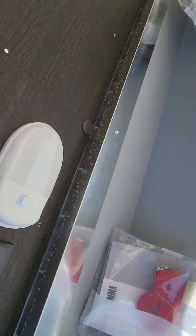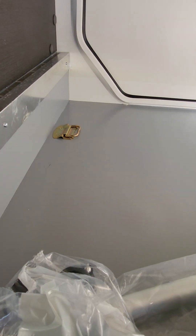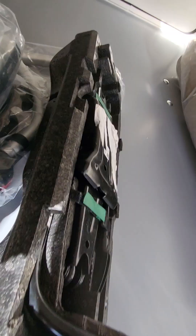Inside there is your boiler drain — you'll see that wee blue lever there. Down the side of it there's a wee blue dot. When the temperature drops below 3 degrees, that wee button will pop out and that lever will turn and drop all your water, just to save it getting frost damage. There's also a heating vent in here, so if you keep the heating on when you've got it packed up at the house, that saves any problems with frost.